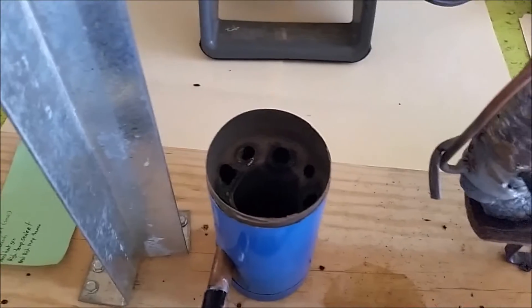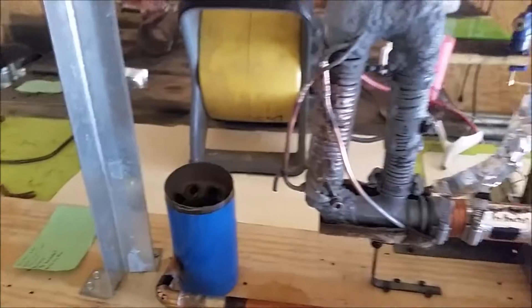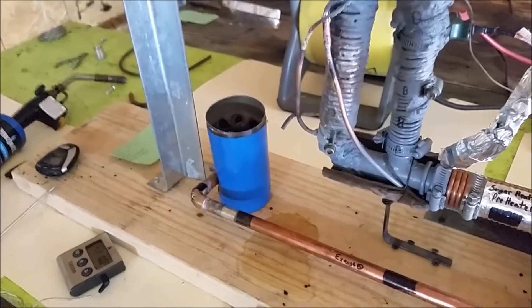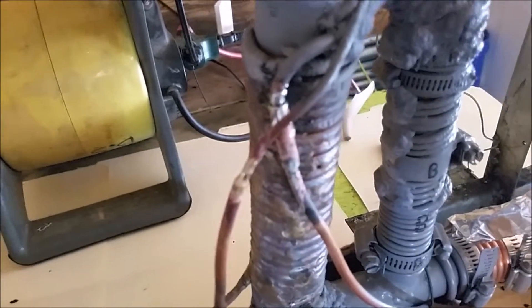Whoa — something's going on inside of there. It's like a jet engine effect. Wow, can you hear that? The fuel is combusting inside the device somewhere. I just got so hot that my solder joint broke there — so that means my steam is over 400 degrees off this superheater preheater. I'm going to have to shut down and stop this here.